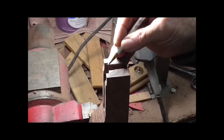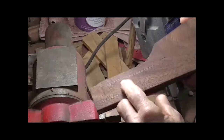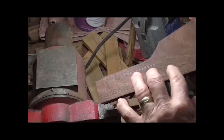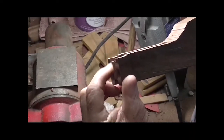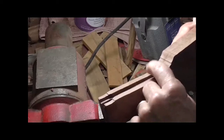It's about a 1/16 of an inch, give or take. So that makes it pretty easy to do. I can chuck it up with my marks. This set of marks right here is where my vise face was. I can chuck it right back up in that same place and just drop all this a 1/16. Maybe a teeny bit light on the back end of it.